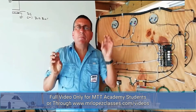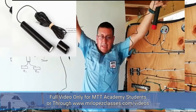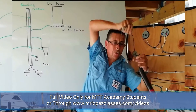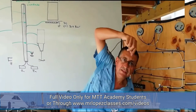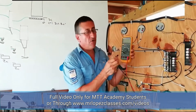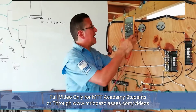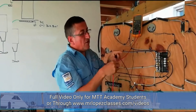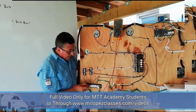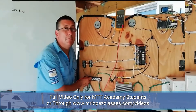What equipment in the boat produces the leak of current? This is a silver chloride electrode. In order to introduce that silver chloride electrode in the water, the other end of the electrode should be connected to the negative of the voltmeter, and the positive of the voltmeter connected to the bonding, in order to verify how much is the reading in millivolts.